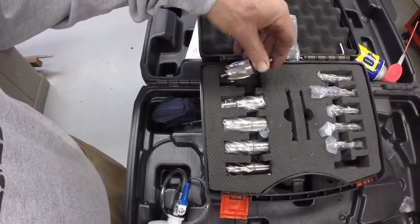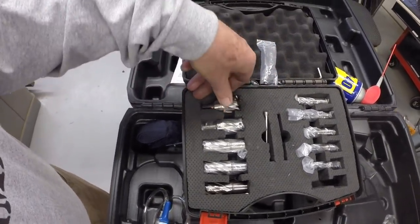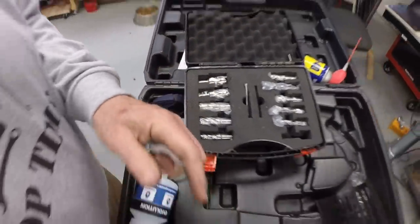So this type of drill clamps to the metal workpiece. Now, I am having a slight issue with it on this tubing, because the tubing is not perfectly flat. That electromagnet, to get the full effect, needs to be on relatively thick metal, like probably half an inch, to get the full magnetic force, and it has to be perfectly flat. And this rectangular tubing is not perfectly flat. It has a very slight curve to it, so you don't get the full clamping force. But if you go slowly, it seems to be adequate.